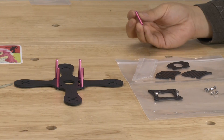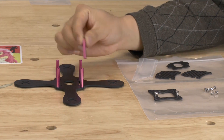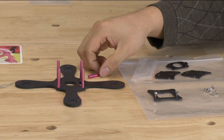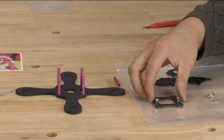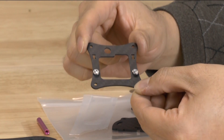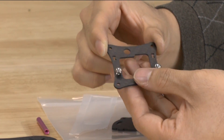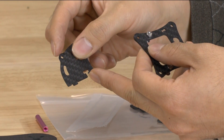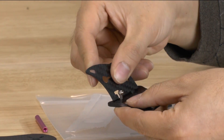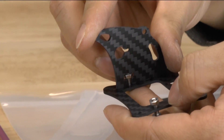So we just started putting this together. Interesting to note is that of the five spacers, one of them is longer, so the longer one won't actually go onto the base plate. But I do like these pink spacers — they're kind of unique and it's nice to have something that's different colors than the ones we're used to. Here is the top plate. The hole represents the back of the top plate, and what we did was we took one of the longer screws and put the nut on top to keep them together. What you do is take this — this unique little notch over here is where that screw is going to go into. So you just face it in the right direction, line it up with the notch in the back, and then put it through and tighten it down for both sides.